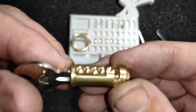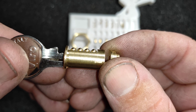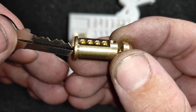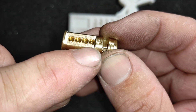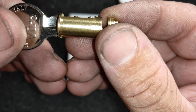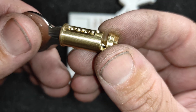So when I put that in - with the key in - it doesn't even make it to the shear line. So at any point I can pull that key out. Obviously when the lock is locked, the key pins are down and the driver pins are down inside, so it can't turn. But once you put your key in, there's enough of a chamfer on each one of those that you can actually turn the lock. Very strange.